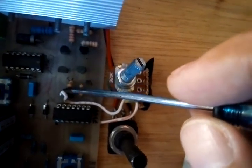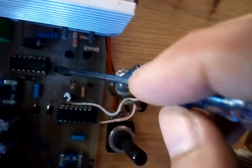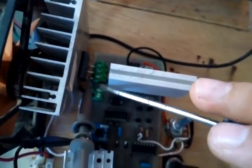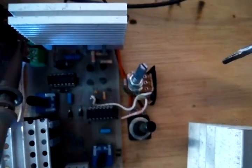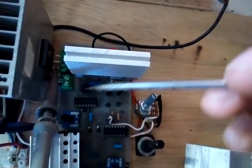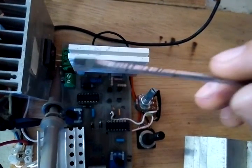This is the resistor protection right before pin 9, 11, and 12, which are sending signals to the transistors. This is actually the part where inverted signals are coming from. I have the probe connected on the base as well, showing on the scope — there needed to be more control on the pulse width of the signal.